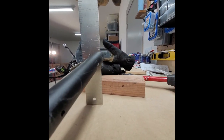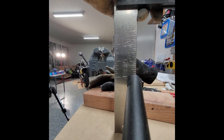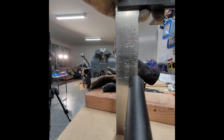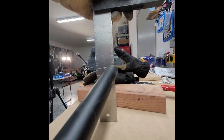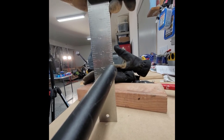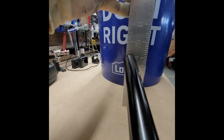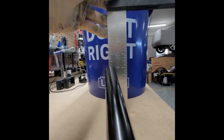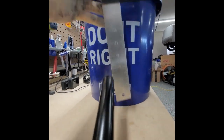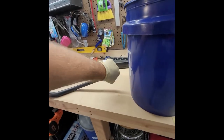Looking straight down, it's about four inches and one eighth — almost four and a quarter, like three sixteenths — so four and three sixteenths on that side. And then here's the other side — dude, so sick, that is legit about the same. So I'm pretty certain this thing is squared up. I'm just going to clean it up and prep it.